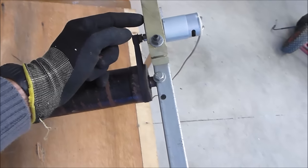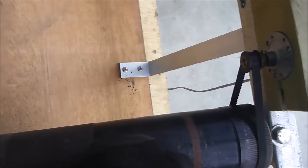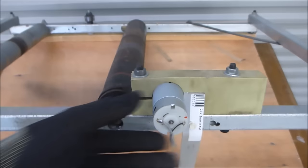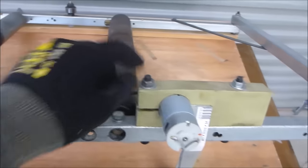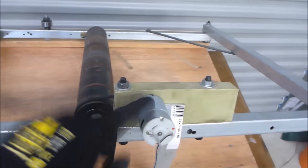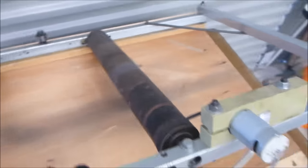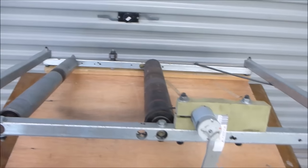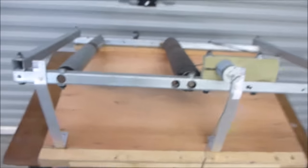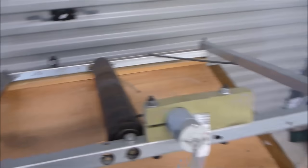It's a 37 millimeter diameter geared motor. One of the nice things about this motor is that the shaft coming out the side is actually offset from the center, which means that when you use a very simple homemade mounting and tensioning system you can just rotate the motor to get a bit of tension on the belt. You don't want to over-tension the belt, but it's something you play with until you get it right. The output speed of the motor is about 120 RPM, and together with the reduction in the belt it works out that I do one full rotation of the big drum in about eight seconds.